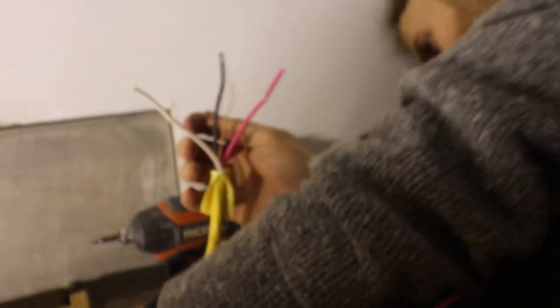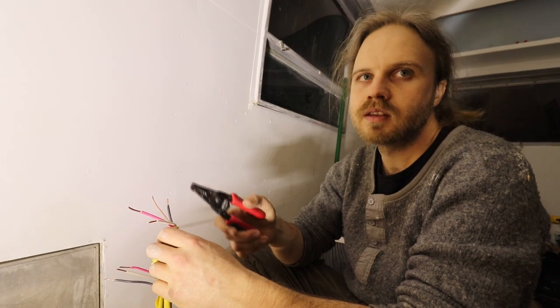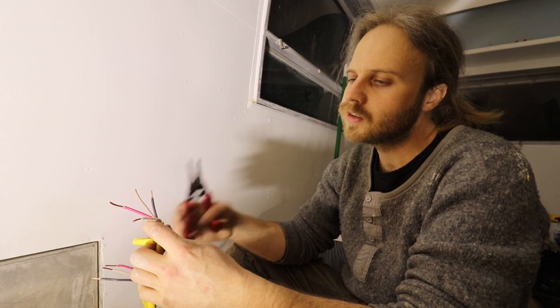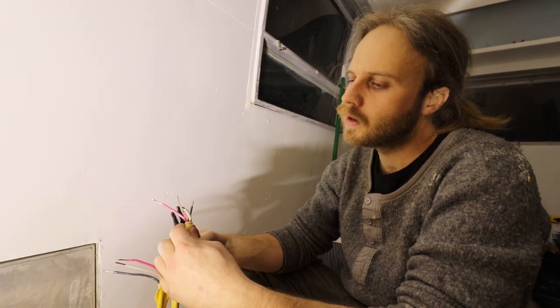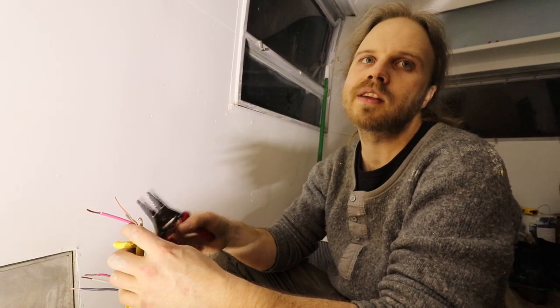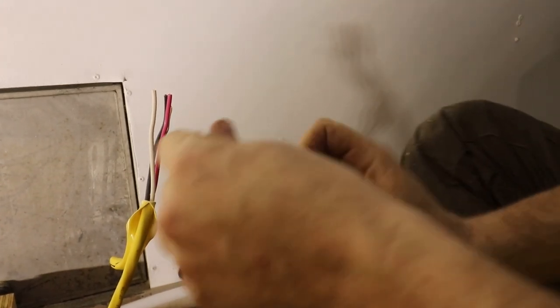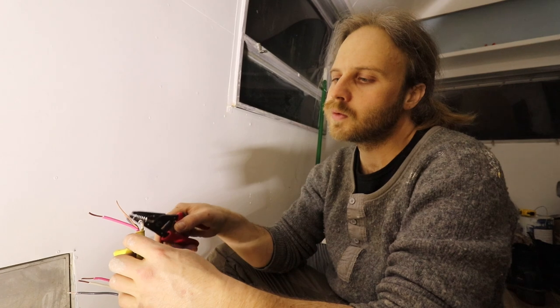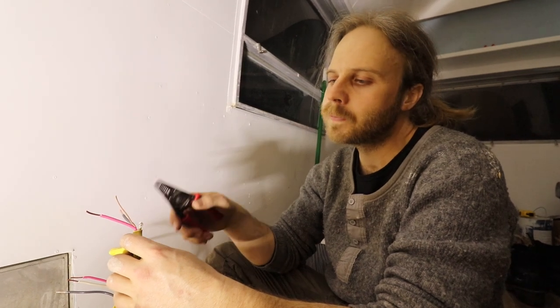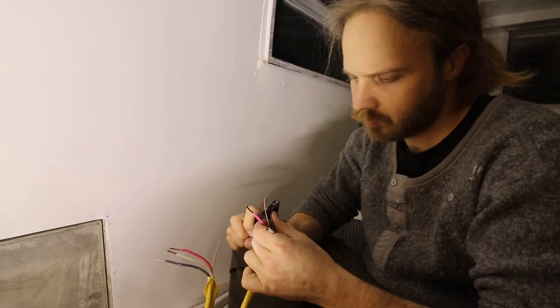We're not doing regular electrical here in our trailer because the only wire I could find that actually had an insulated ground wire was this one that had three insulated wires running, slightly more insulation. So in this application, we're gonna have a white neutral, a red hot, and a black ground, and we're not gonna use the bare copper ground. And I'm gonna make a note in the breaker box to state that that's how the electrical has been run, so if anybody ever opens it up, they know that the black insulated wire is being used as our ground. Just to do with vibration and movement, I didn't want to be in a situation where we end up grounding our electrical on something else, so I figured better safe than sorry and have an insulated ground. So I'm just going to clip these bare wire grounds back and wire up this black wire to be our common ground.